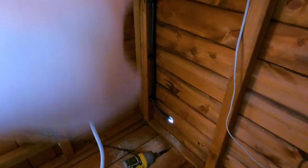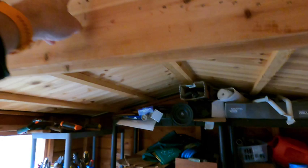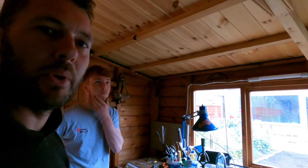Jack's brought the armoured through down there. He's clipped it all up. The idea is the socket's going to be there, switch spur next to it, and then the light. Because of this bracing piece here, we're not going to be able to go through there to put the light over that side — so the light is going more this end. There's that four-foot. Could have put two little bulkheads in, but we haven't, so that's what's going in.